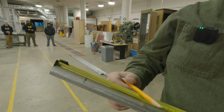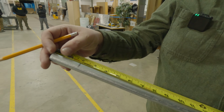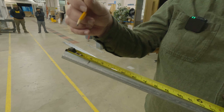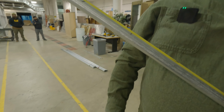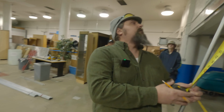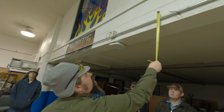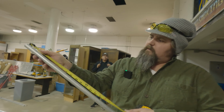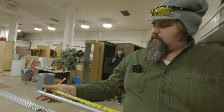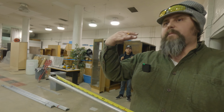30-degree bends, 2's your multiplier. So basically 4 inches in between that. So 6, and we want a little bit of space in between it. And just make it 2. Two's really hard just because they're all so close. If you can get a bigger offset out of it, as far as your spacing in between, your bends are going to look a lot better.